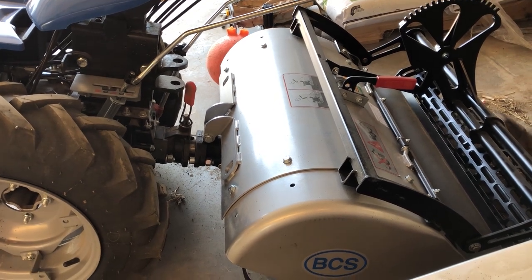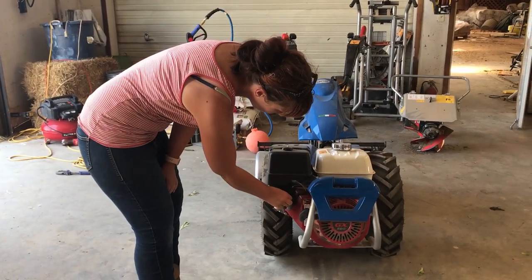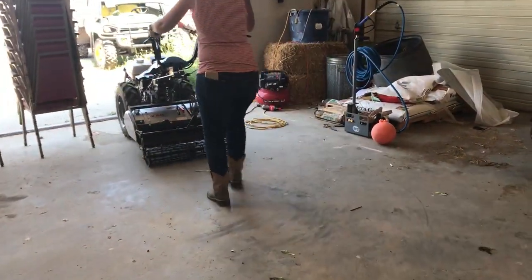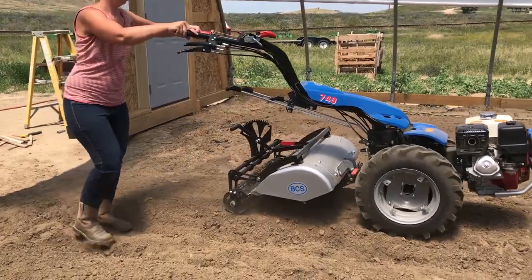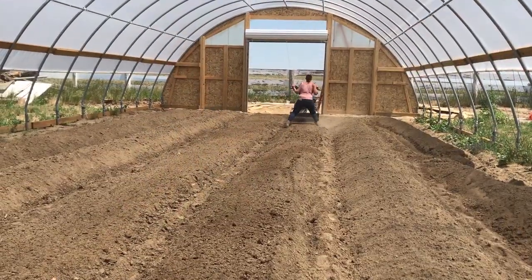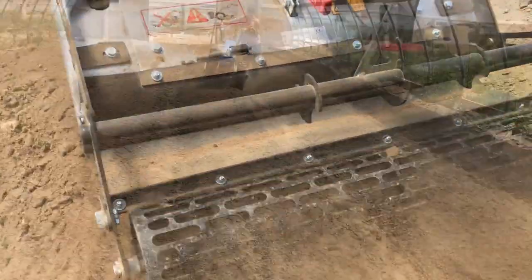The rotary plow is dropped off and the PDR is hooked on. Both of these implements run on the back of the tractor so we don't have to swivel the handlebars when switching between them. The PDR is a brand new accessory that allows us to control the depth at which we till and also gently compacts the top of our raised beds, which will be extremely beneficial when directly seeding. It also makes transport of the tiller much easier — just set the depth adjustment to high and we can move the tractor and tiller easily from the shop to the tunnel. The PDR is run over the top of the roughly shaped raised beds, making the surface nice and flat and level. We've already worked in our soil amendments, but if necessary, compost could be added to the raised bed during this step.